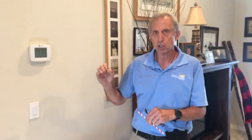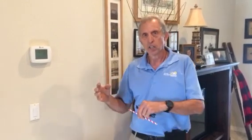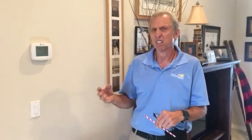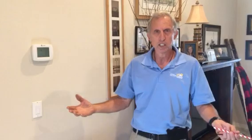There's really not that much to it, because most people don't really want a run program except those folks that possibly get up early in the mornings, work all day and come home at a certain time. But even then, here in Southwest Florida, we always tell our customers to leave it on 76, and usually that's pretty good, because just keep in mind that the dehumidification level of your air conditioning system is at 40% humidity when it's operating. So we want to keep it anywhere around the 55 percentile. That's perfect. So we're usually pretty good at that temperature.